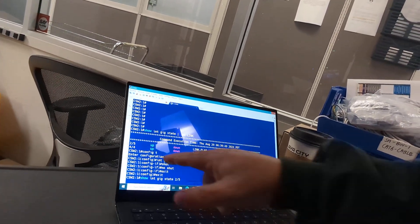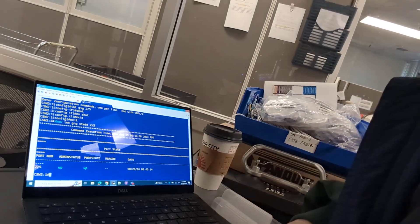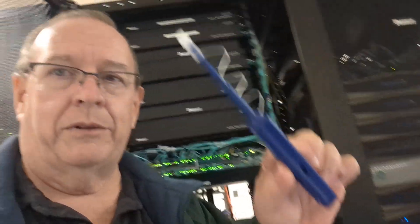So I'm going to do this to the other interface as well. I'm not going to make you wait — you saw what I did: pull it off, clean it with the clicker, plug it back in, bounce the interface, and that should bring it back up. It does bring it back up. So now we'll just see how long this lasts. May have to go out to the other end, which is more than likely where the dirty fiber is, because that's out in the closet. It's fairly clean in here, but out in my closets it can get a little dusty.